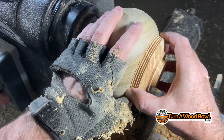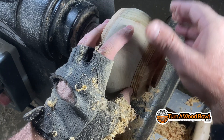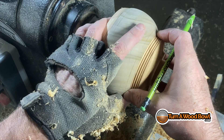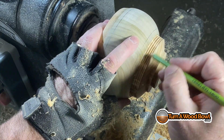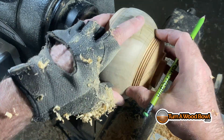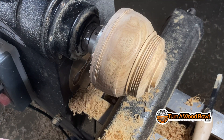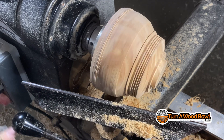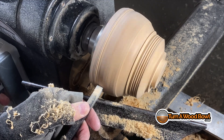We've established the bottom, and I'm turning away what I cleared out with the carbide scraper — there's a little hollow area that's going to allow that to seat. I'm marking this as my outside edge. That rim is lined up with the surface I'm marking, so I need to clear away those extra rings on the bottom to bring up the bottom of the bowl. To do that I'm going to get my half-inch bowl gouge, but first I'm going to scrape and determine the top edge.